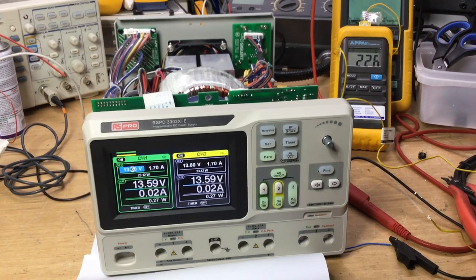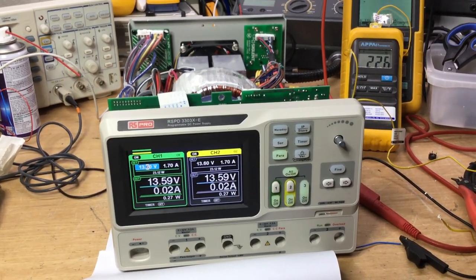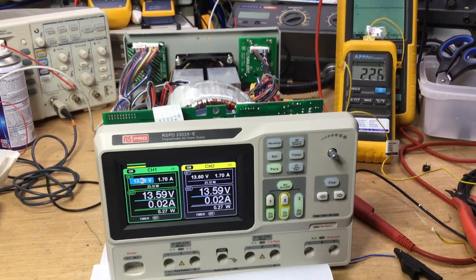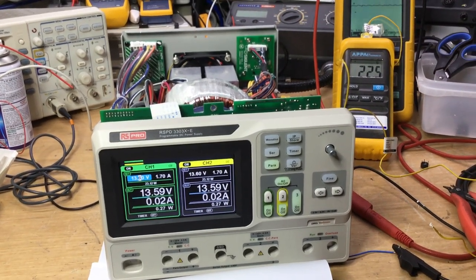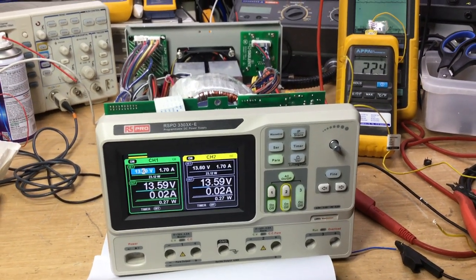But I do know on the EV blog forum, there was a guy on there had the same problem with the bridge rectifier on his model. So whether it's a bad batch of bridge rectifiers, or from running at that temperature all the time, prolonged use, they're bound to fail. So if it fails again in time to come, hopefully it'll carry on working.